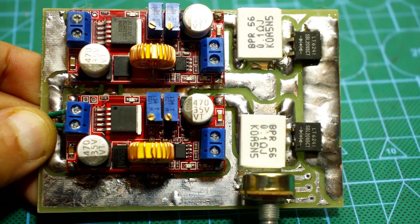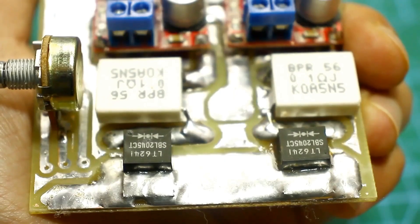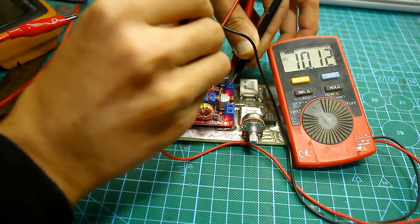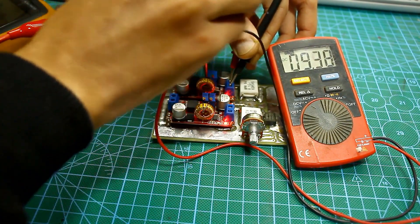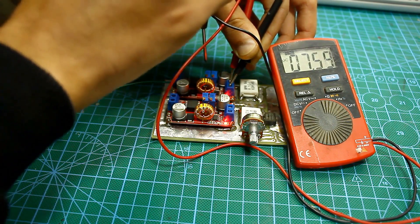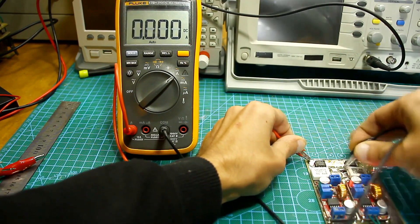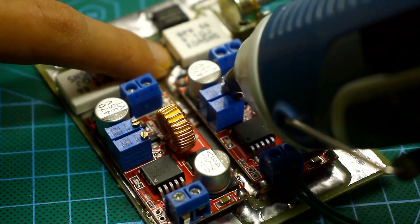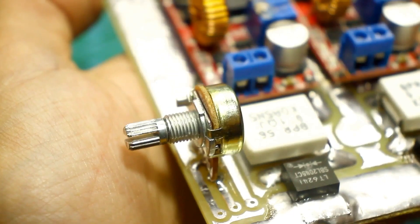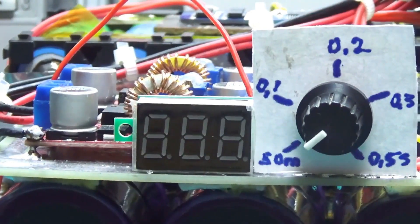The regulators were installed on a separate large board, along with the resistors and diodes. In the circuit, I used one more powerful step-down regulator. The Schottky diode prevents current from flowing from the supercapacitors to the stabilizer board. This setup is done before connecting the supercapacitor battery: place one probe of the multimeter on the cathode of the Schottky diode and the other on the ground, then by turning the trimmer resistors, set the output voltage. Next, set the multimeter to ammeter mode, and by turning another trimmer resistor, set the maximum current limit to 9 to 10A. The Schottky diode must be mounted on a heat sink. After the setup, the screws of the trimmer resistors were sealed with hot glue. The variable resistor responsible for the welding time was brought out to that large board, and an analog scale was made showing the welding time — set the required time depending on the thickness of the nickel strip, and off you go.